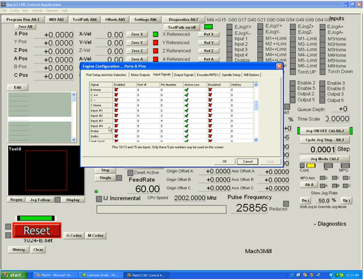There are other inputs: Input 1 through 4, which can be referenced in logic screens — for example, telling Mach 3 to hold movement when input 1 is active. There's a probe input used for digitizing, sometimes called probe skip, which stops a command when the input comes in. We have an index input to read spindle RPM, a limit override input that mirrors the settings tab button, and THC on — used to indicate that a plasma torch arc is in good cutting condition. The program can stop movement or abort jobs if THC on goes inactive.